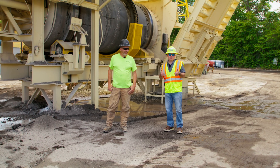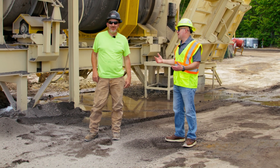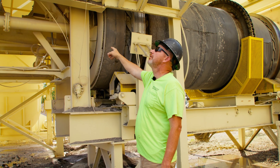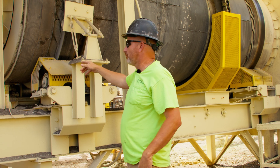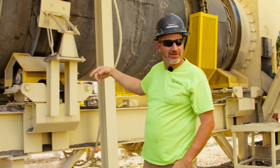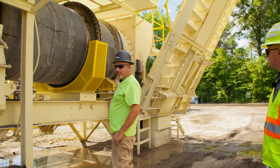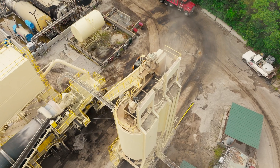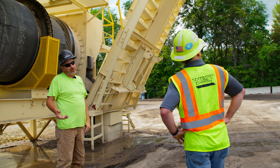Here we are at 4:15 on Friday, still waiting for the crew to call whether they could go home or not. You've got your dryer up there where you superheat all your rock, it'll drop all your rock down the chute here along with your RAP coming up that belt and dropping down in that chute, then they'll go into this mixer. Everything should be pretty warm by then, and your oil will also drop into the mixer. Then you've got your dust blowing in there. Everything will turn and mix for about three to three-and-a-half minutes until it comes out of that chute — that should be good asphalt. It hits your drag, goes up your drag to your silos, and depending on which silo you want, there's an auger up there on a swivel so you can pick which silo you want to put it in to store it and load out whenever it's ready.